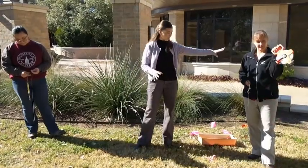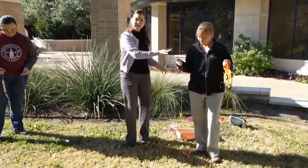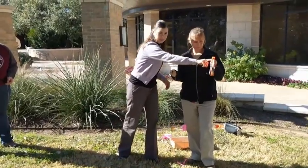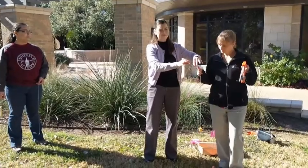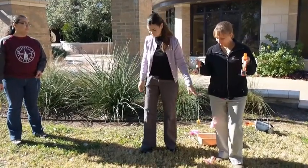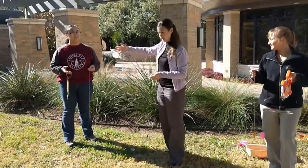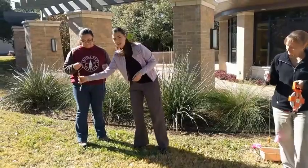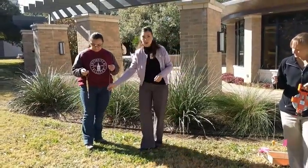Dr. Andres over here is going to be at the first spot, and the person who stays here needs to keep the steel tape, a clamp, not the handle, the clamp, and a plumb bob, okay? The other person measuring the distance will be Lauren here, and Lauren has to bring the tension handle that's been calibrated, make sure you do that, and a plumb bob.